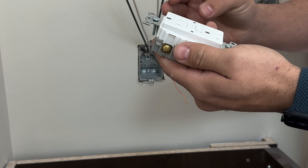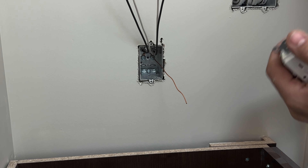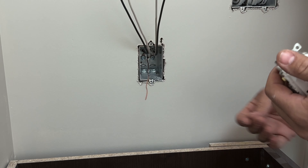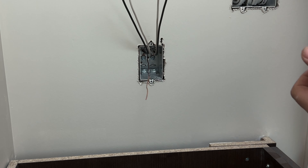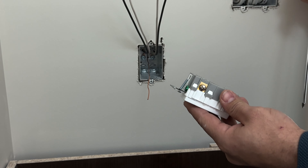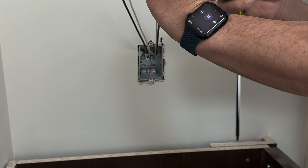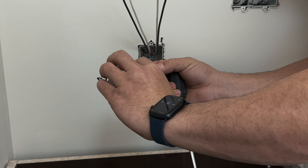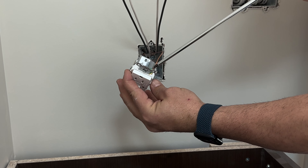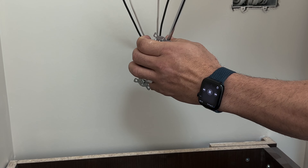In this case we have line and we have load. We noticed that the wire got nicked by the drywallers and their wiring tool, but we have a solution for this — we anticipated that this may be an issue. We usually leave a very large loop of wire, as you can see, sitting above the box so we can pull it and get rid of this inconvenience.